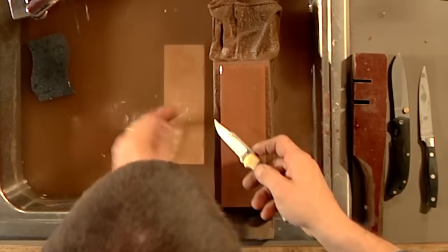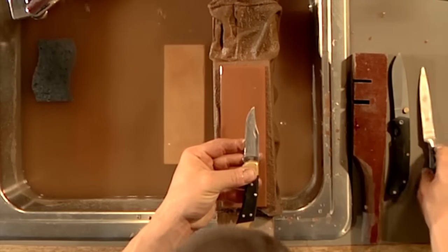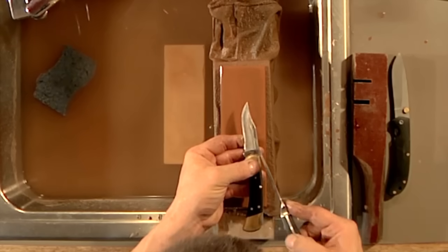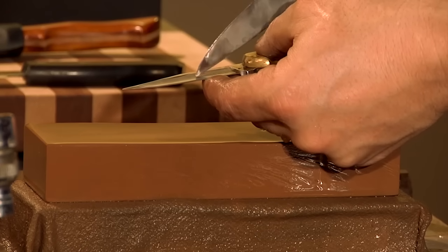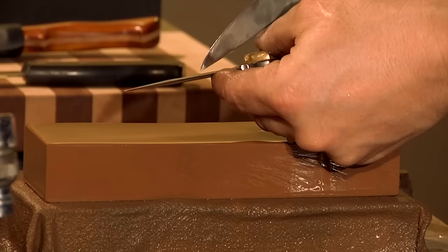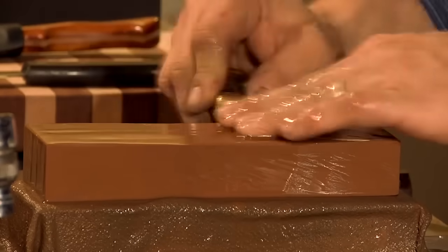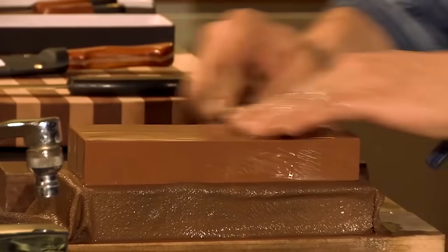So there's the secondary edge on one side. It's difficult to pick up, but I've ground a whole bunch in here and a little bit up here. Again, with this kind of a dramatic hollow grind in the blade, it'll probably take 10 repeated sharpenings before that'll kind of close in and become a flat surface. But I still can see the original primary edge. I'm only doing this secondary edge at this stage. These Buck knives really benefit from this kind of a thinning.